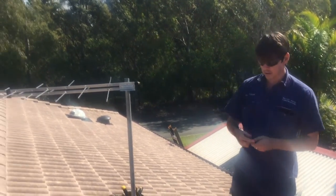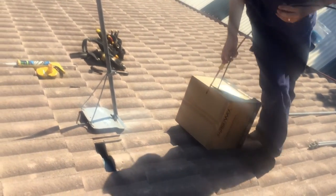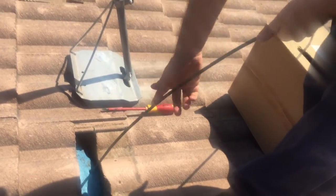Now that we've got the antenna mounted, we need to get the cable into the roof. I've already got this tile kicked up a little bit here, and you can see this is sarking inside the roof. I'm just going to punch a small hole with my screwdriver in there — just the smallest possible hole to get the cable through. I'm just going to run enough cable into the roof cavity to get me to where I'm going to install the two-way splitter. Depending on what number of TV points you want to have, you'll have a different type of splitter or no splitter at all.